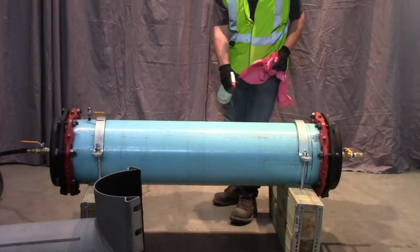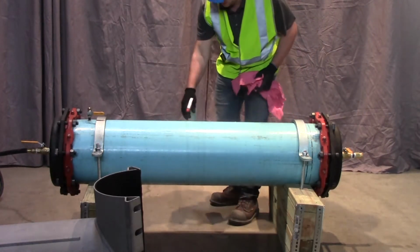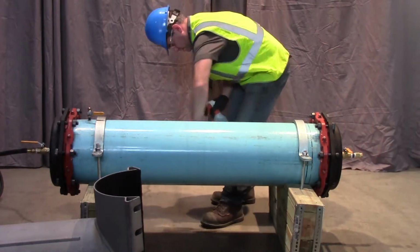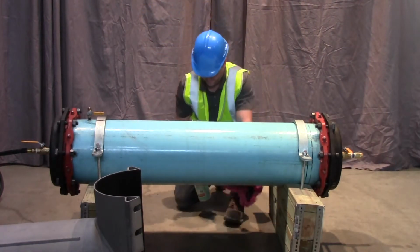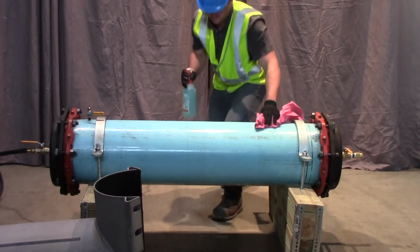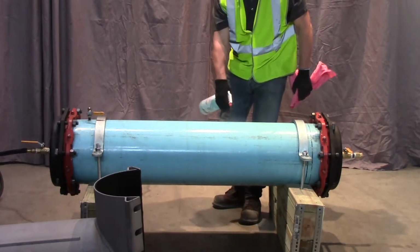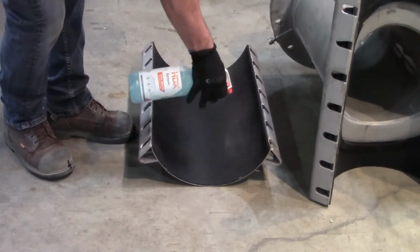Thoroughly clean the pipe surface where the valve body will be installed and inspect for flaws, such as gouges, protrusions, or excessive corrosion. Irregular surfaces should be avoided to assure maximum gasket sealing. Lubricate the top and bottom of the pipe and mat and branch gaskets with a soap water solution. Ensure branch gasket is adequately lubricated.